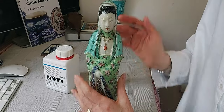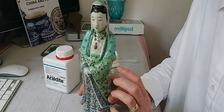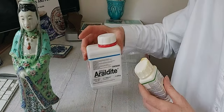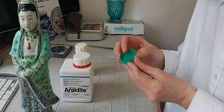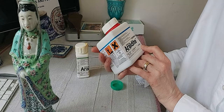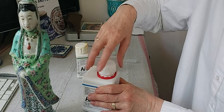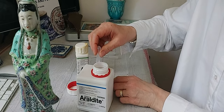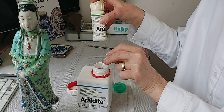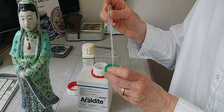Once we've taken the glue off — I presume the glue they used was very thick so it wouldn't have penetrated into the porcelain. Now we're going to take our Araldite. First I'll take our little bottle top and take some of part A — give it a bit of a shake. The ratio for this is three parts of part A to one part of part B, so we need three parts of A. You can measure it out; I'm just doing it by eye. You don't need too much.